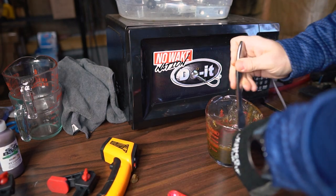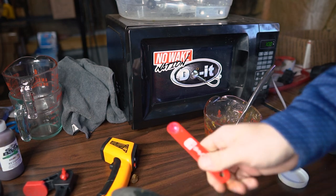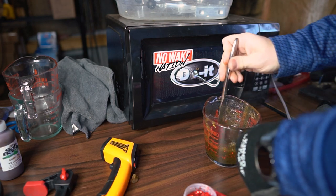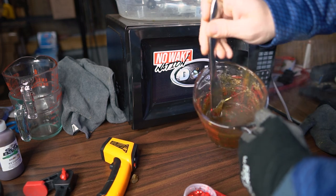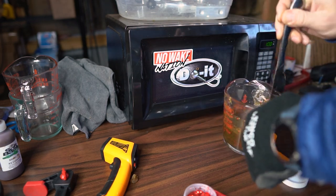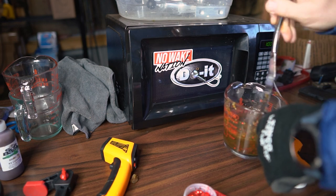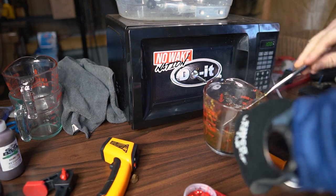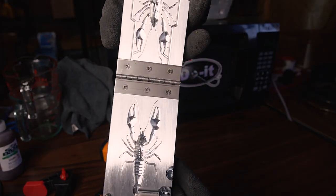The plastic's starting to thicken so we're going to heat it up again. You can already see that black flake looks perfect. Now I'm going to add the red — about a quarter tablespoon, maybe a little less — just as an accent color. Red is such a good color in the springtime. Actually, I think I'll add a little more, maybe an extra sixteenth of a tablespoon, to get a bit more red in there. I like to bring the temp up to 360-370 degrees since it's so cold — I want it to shoot into the mold clean.